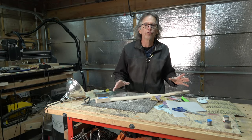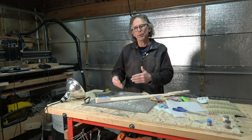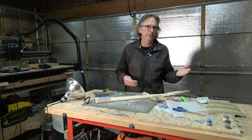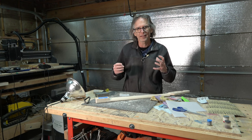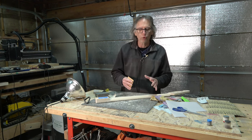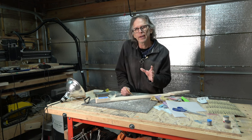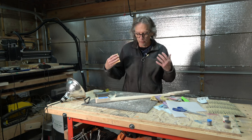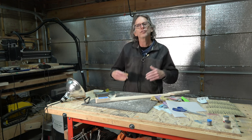I have finished sanding the surface with the 220 grit. So now I'm going to step up to 320 grit and remove those 220 grit scratches, replacing them with 320 grit scratches. Then I'll move up to 400 and replace the 320 grit scratches with 400 grit scratches. When you start sanding to remove tool marks, that's where you do the most work — that takes the greatest amount of effort. Once you have removed those tool marks, you're moving through each grit replacing the previous grit's sanding scratches with the current grit. By the time you get to 400 grit, it's really hard to see those sanding scratches with the naked eye, so you can stop and apply your finish. But as I'll demonstrate in a future episode, the way I apply my finish takes it to an even higher level.